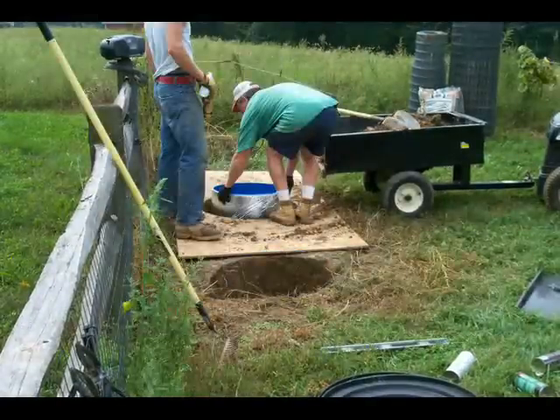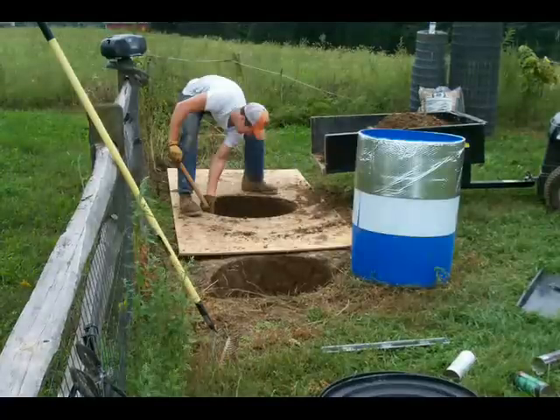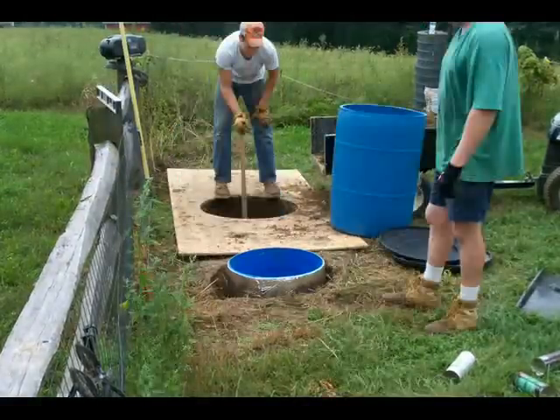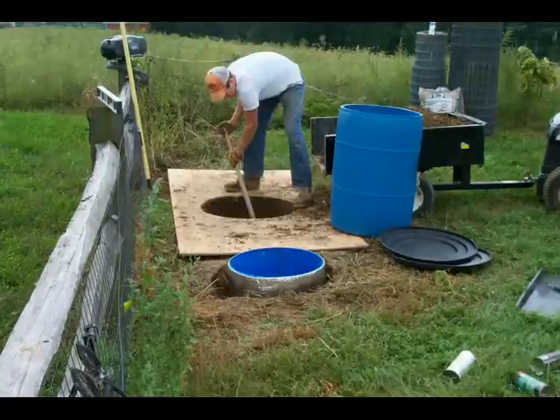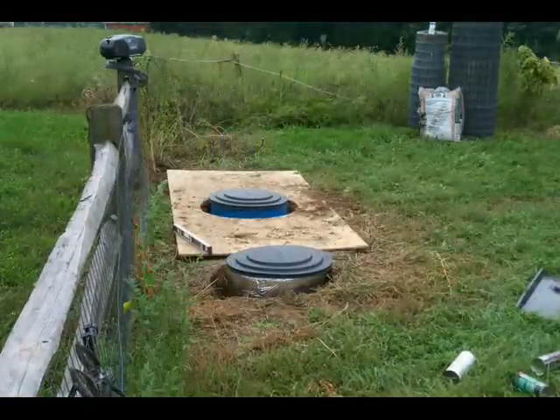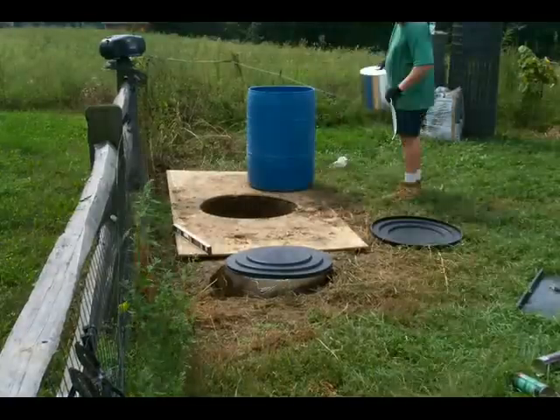That could be modified, and I'll have to do some tests on that to see how it's working. Once you get the barrels in, you have to make sure they're level so you don't get liquid pooling in the bottom. A lot of these vegetables like to be stored at 95% non-condensing relative humidity, so there will be some liquid in the bottoms.